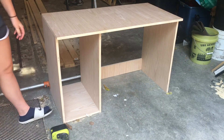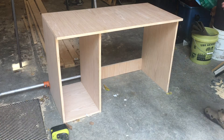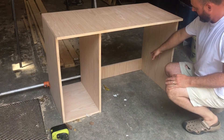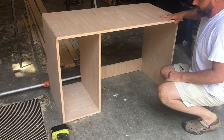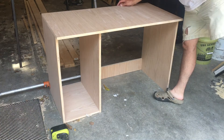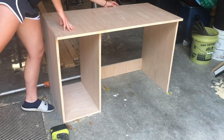Here's your judgment call: you could brace the top under here out of sight, or since we're going with kind of a utilitarian design, you could put the brace on the bottom where you can see it, where it would sit against the wall. It does stiffen up your desk a lot. That's the option we're going to go with — not that you couldn't do it the other way and screw it to stiffen it; we're just choosing not to.